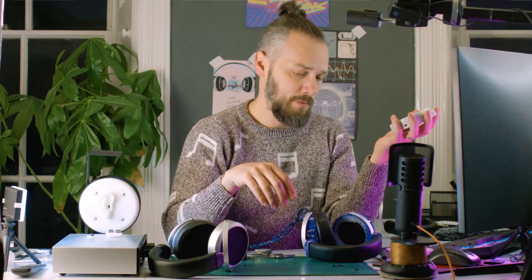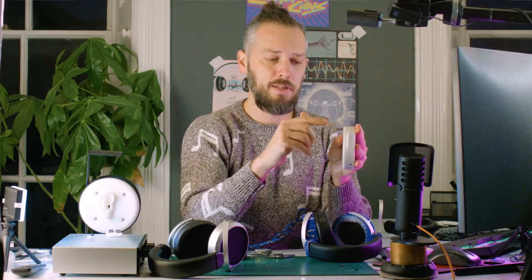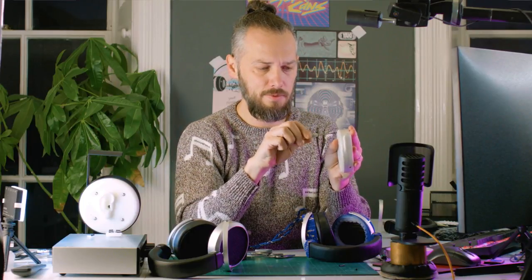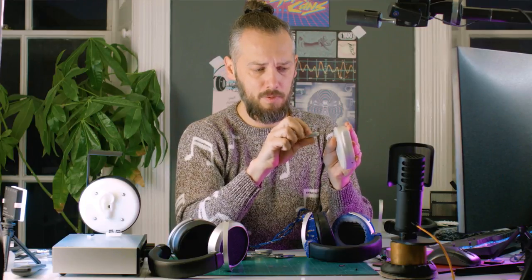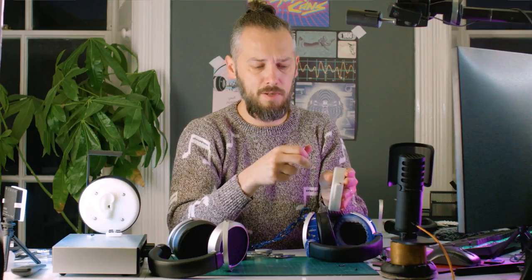As you're assembling it, you want to put in all the screws and squeeze down very tightly so that these will tap into the plastic. I think you can reuse the original screws, but it's not how I've designed it to work, so we'll just pop that in there. What I'm doing is squeezing tightly while putting it in, which ensures that as you put the screw in, it doesn't push the sandwich apart.